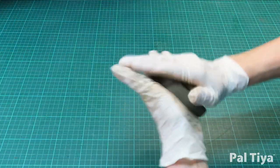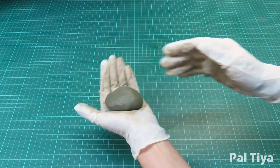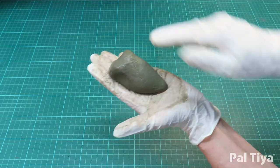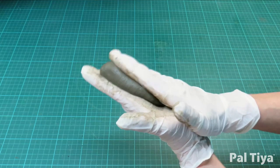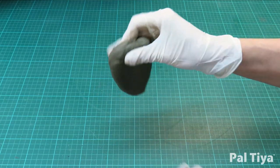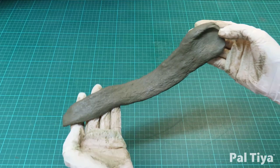Here's a little trick to confirm your mix is correct. First roll it into a ball, then into a cone shape. Place the cone in your hand and press it into a wedge. Press the centre three times and vibrate it so it makes a ribbon. If it does this without ripping, then you have a good mix. It can take a little time to practice this.